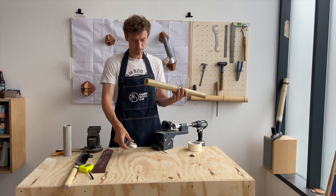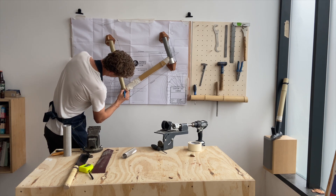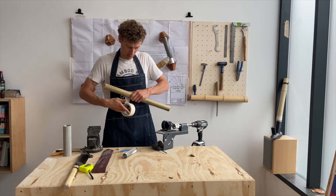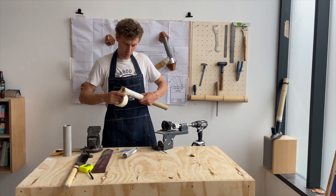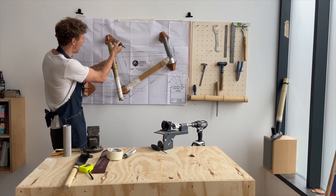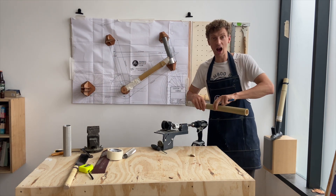I've checked that, so I'm going to go over to my frame and mark this off at the middle of the bottom bracket. I'll take some masking tape and where I've made the mark I'm going to mask this down. I'm going to go back to my drawing and check, then offset the gap a little bit so that I can wrap the seat post shim in fully. I'll just make a mark here and then that's ready to cut.